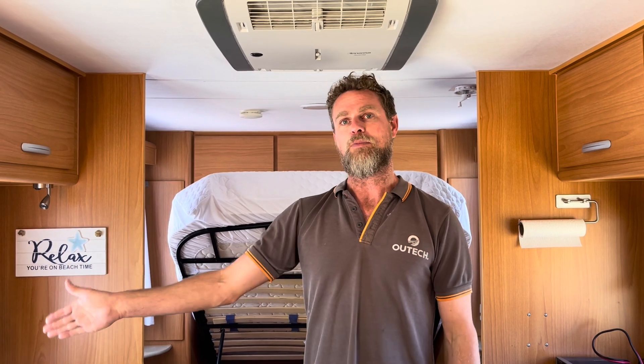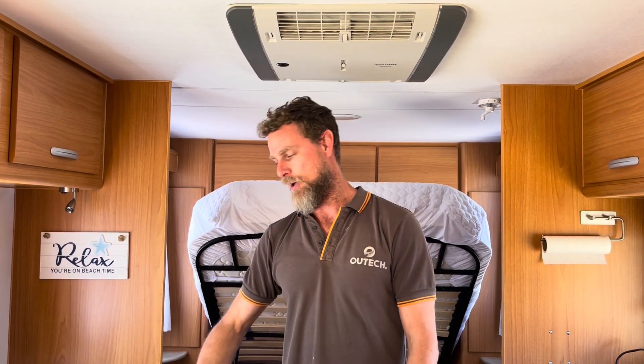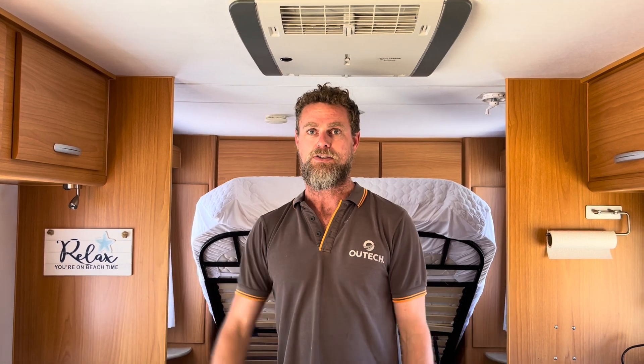As an example of why this matters: something sharp gets dropped off the table, cuts through the cable penetrating through the side of the seat with no mechanical protection, cuts into the cable, and the person goes to grab a metal appliance and gets electrocuted. Those are the reasons why we need to follow the rules. When I see those sorts of things, I have to notify the owner and fix or isolate them — those are the only two options. Generally we fix it.